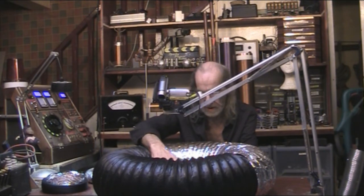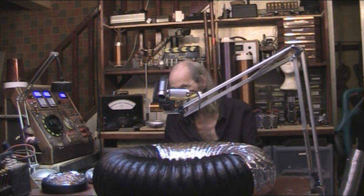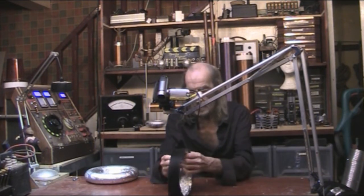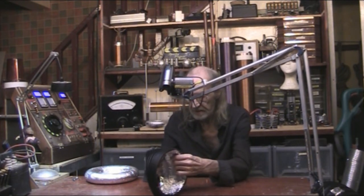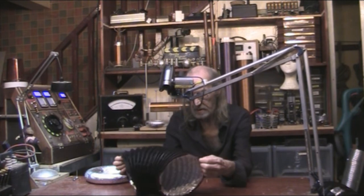I made the inner out of four layers of cardboard, then there's another couple of layers of cardboard that's smaller and that's to centre on the secondary. I worked out the dimensions of the toroid so I knew the outside diameter, and from that you can calculate the circumference. I stretched the ducting out nice and tight and measured it to that length plus two inches to account for the overlap width.